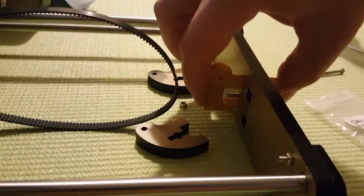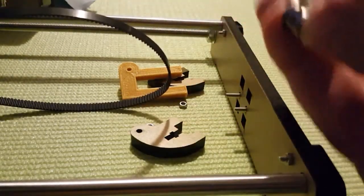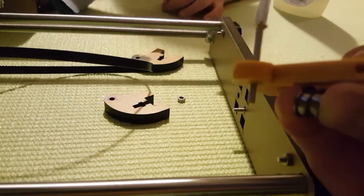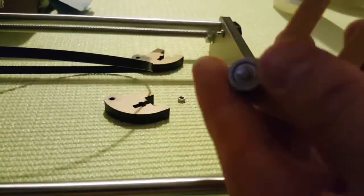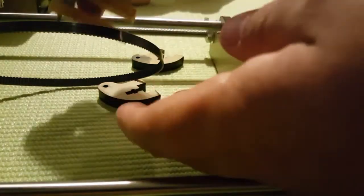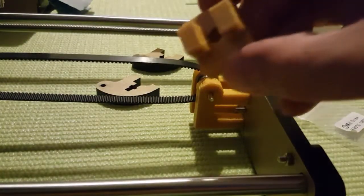It's working. Take another one — during 3D printing, parts can have some tiny differences, so you can use sandpaper to make it fit. You can see immediately how the belt becomes very tight. We can adjust the tension with this part from the other side.